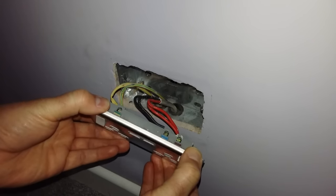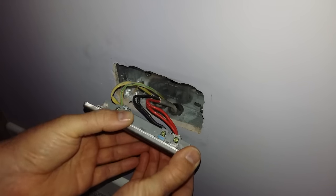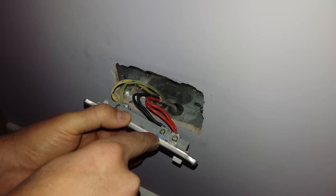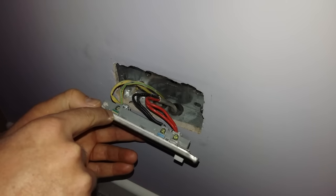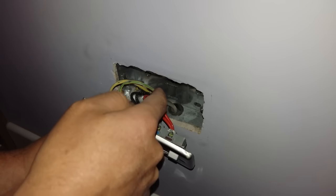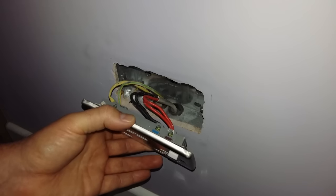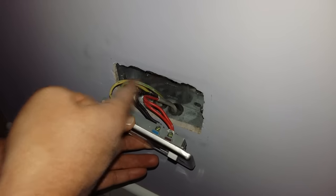Alternatively, you could be met with this older colour wiring on the back of your socket. If you are, this is how you would match them up. Your red is your live, so the red goes to the brown. The black is your neutral — that goes to the blue. The earth is still green and yellow, and that goes to the green and yellow. As with the newer style wiring, you'll have a live in and a live out, a neutral in and a neutral out, and the same with the earth — in and out. Again, this could be at the end of a spur, in which case you will just have one live in, one neutral in, and one earth in.